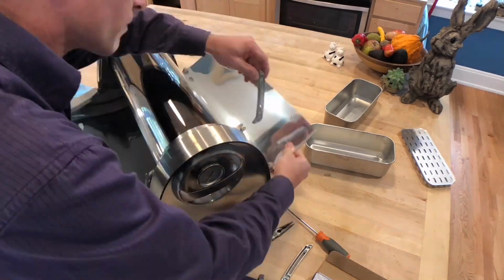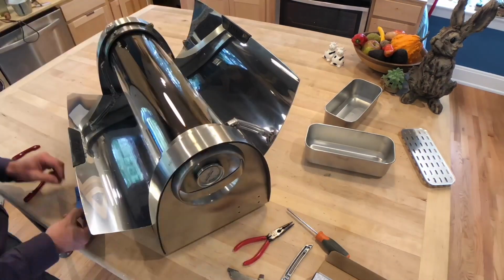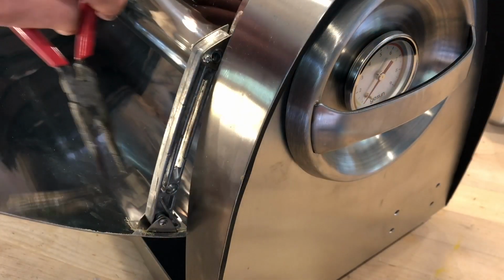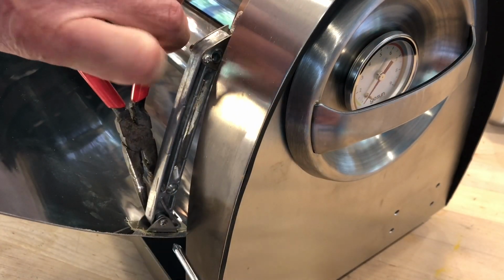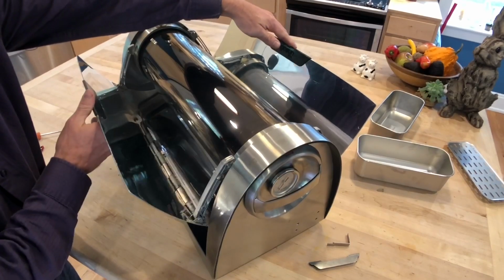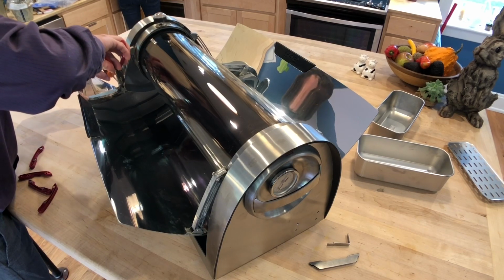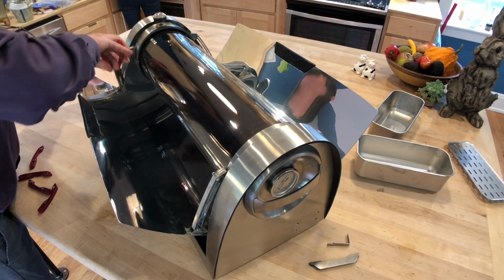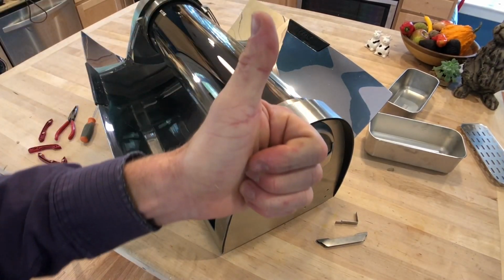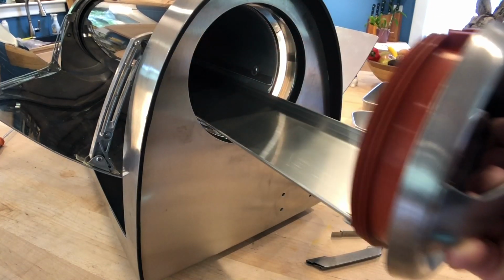Go through the same holes on the grill and run the little bolt through the long top slot on the bracket when putting them back together. Tighten up the bolts just beyond finger tight, but there's no need to compress anything. Check the motion, and if there's a lot of friction, you probably over-tightened, and you need to back off the tiny bolts a little. Once all those are in place and you're happy with the motion, let's get things working on the inside of the tube.